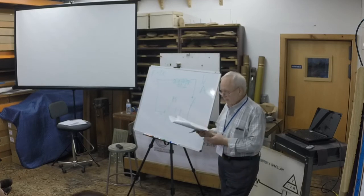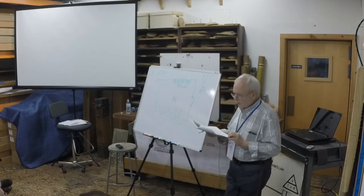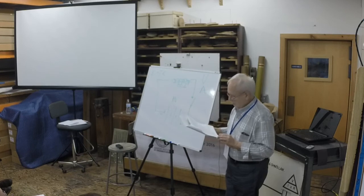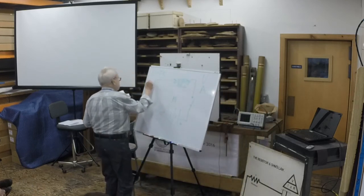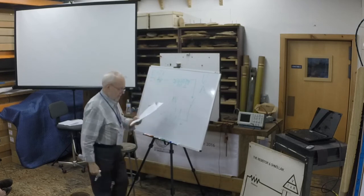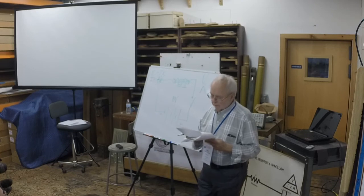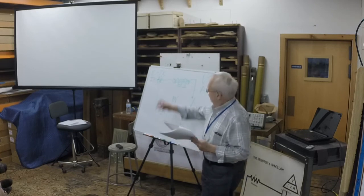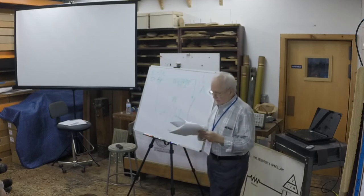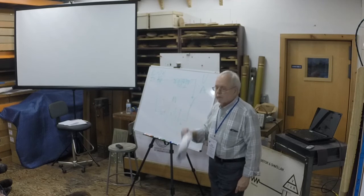So how much current? It's pretty easy with these numbers. The current is equal to the voltage divided by the resistance, or 10 volts divided by 100 ohms, or 0.1 amp. So this one magnet here will consume 1/10 of an amp of current at 10 volts. If you make 100 of these guys work at once, your battery will need to deliver 10 amps without collapsing.